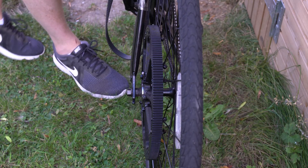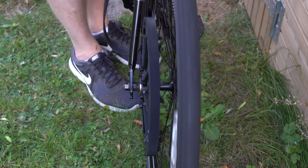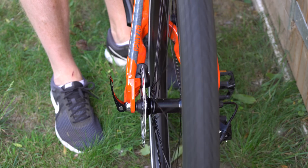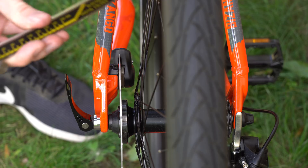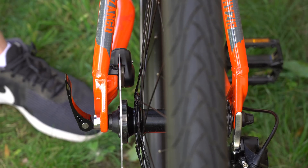This is the bike I used for the previous electric bike versions and as you can see there was plenty of space between the frame and the wheel making it easy to mount a pulley. However on the new bike there is a disc brake on this side of the wheel which restricts the usable space by quite a bit. It's not necessarily the disc itself that's the issue but instead the brake caliper, leaving around six millimeters of space between the spokes and the brake.